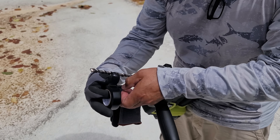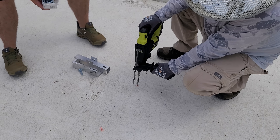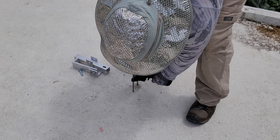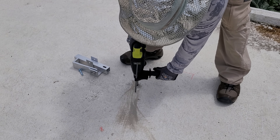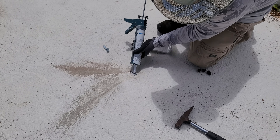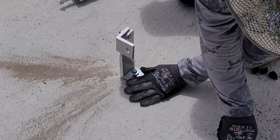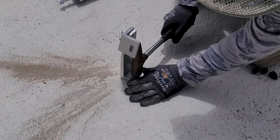To make sure we don't over-drill, we put a mark on the drill bit to show the exact depth needed for each bracket. While I'm marking each spot with a red pencil, Alex is using the hammer drill to go about two and a half inches down into the concrete roof. The concrete roof is about four inches thick, so we're not close to causing a problem with over-penetration. We use solar roof caulking designed for concrete roofs to ensure zero chance of water leaking inside. Then we install the IronRidge L-bracket, use a two-and-a-half-inch concrete anchor, hammer it in, and tighten it up — that's going to lock it in forever.